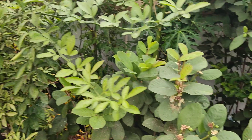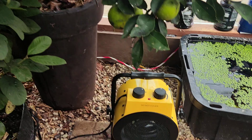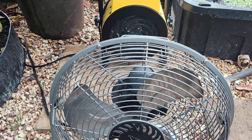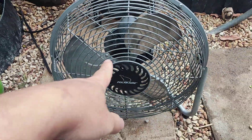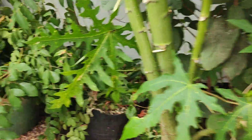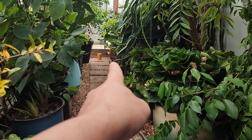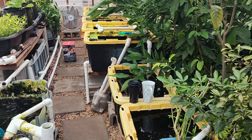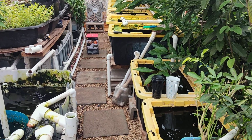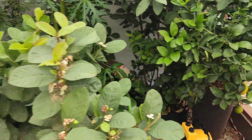I have another sensor for this heater here, and this sensor is set for below 35 degrees. If it gets really cold and falls below that temp, this will turn on, this fan will turn on, and it will push the air more. The air from here pushes that way, and that heater pushes air this way, so the cold air keeps moving while it heats up the greenhouse with the tube heater.